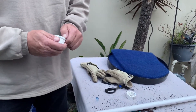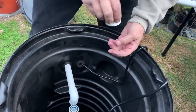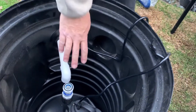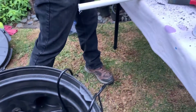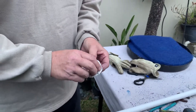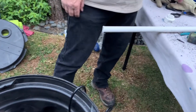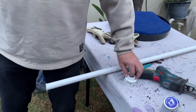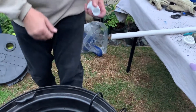I almost made a big mistake — the glue spilled over, and if I had the two pieces together it would have sealed the union so it couldn't come apart. That's why I took it apart. I glued the bottom union down, and now I'm going to glue the top portion of the union too. Always make sure you have this portion in there before you glue it. From experience, I know I have an inch in here and I should have an inch there, so I'll measure the difference between the two to find out how much I need to cut. But first I'm going to glue this portion onto this elbow.